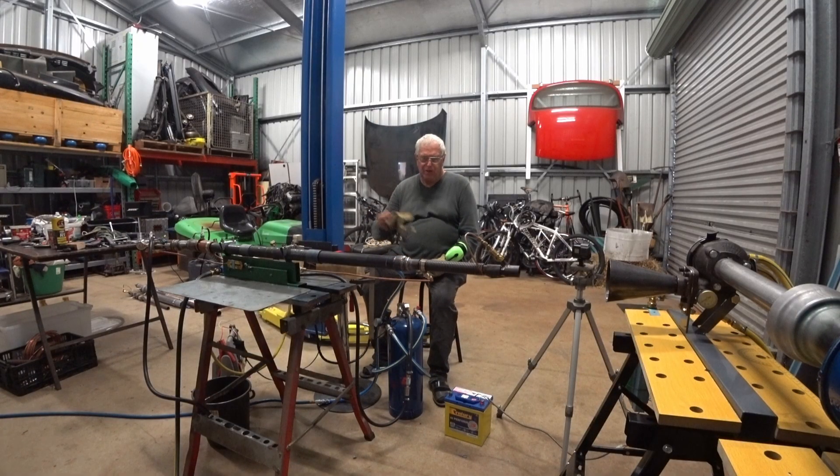We have been using the smaller three-quarter sized piping and I've had an issue with the turbine not turning because the bearings are all too tight. So I put the original one and a quarter inch pipe system back together again, because when we were using this we weren't quite getting the amount of power that we expected — but it seems to be getting a lot more power now. I've actually had it running with the 4-inch extension on it.